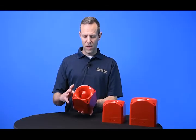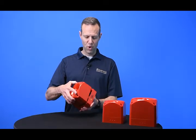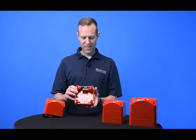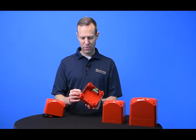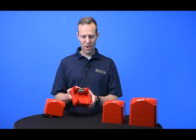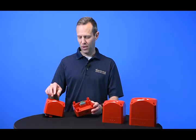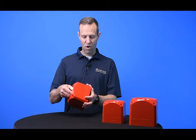The units all come as a single piece like this, but there are four screws in the corners. When you open them up, they separate into a head and a base. The base has mounting holes you can use to mount it, and there are dimples for drilling penetrations. So you can mount this against the surface you wish to mount it on, take care of your cable terminations per the wiring, and then the head just goes back on that base.